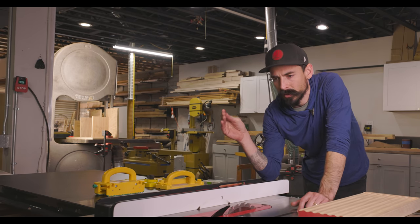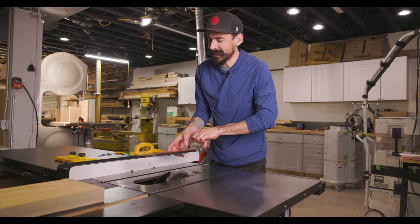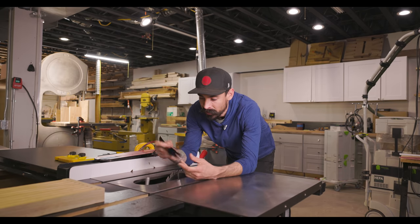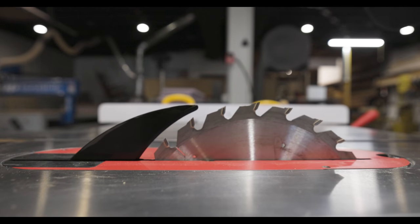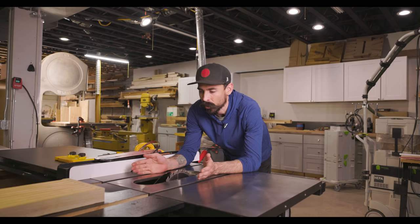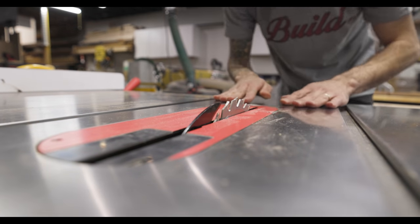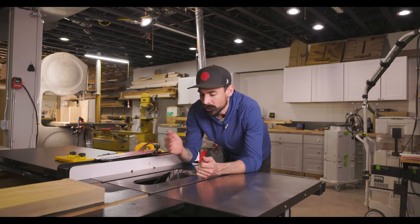I knew it wasn't going to be an issue, but I can be better — I probably should have found it and stuck it back in to be safe and set a good example. So what is a riving knife? It's a thin piece of metal that rides in the arbor behind the blade, slightly thinner than the blade thickness. Lumber yards often expedite drying, which builds up moisture in the center of boards, causing them to pinch the blade. If the riving knife isn't there to act as a wedge, the wood can pinch the blade, project it back at you, and in the worst case drag your fingers through as well.